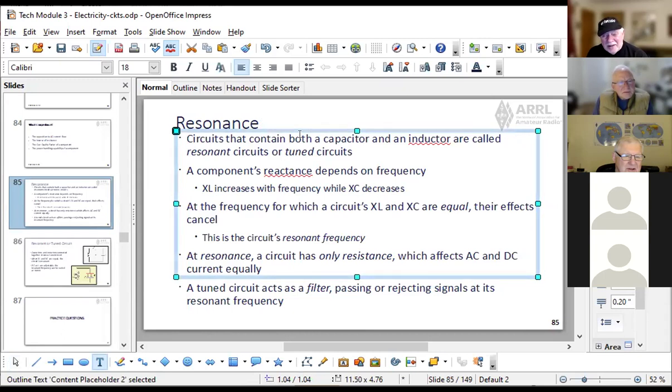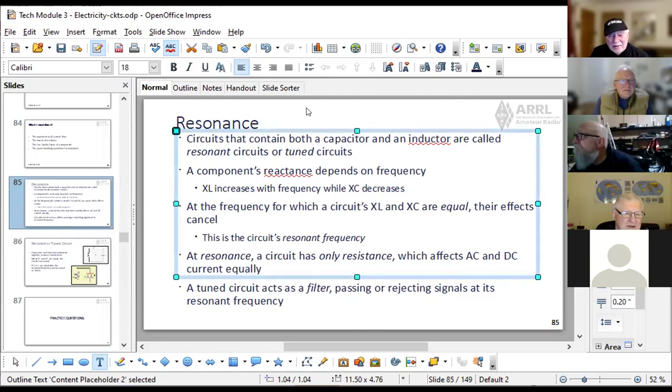We'll talk about antennas a little later. But for 15 meters or 21 megahertz, instead of 32 feet, I need 21 feet. So that trap will not allow the 21 megahertz signal to go to the end of the antenna. It keeps it within a 21 foot length. And if I'm operating on the 10 meter band or 28 megahertz, the third trap will operate only if I'm operating on 28 megahertz, and it will keep my transmitter power from going beyond 16 feet. So that's one of the beauties of a trap.